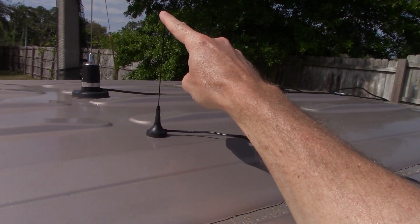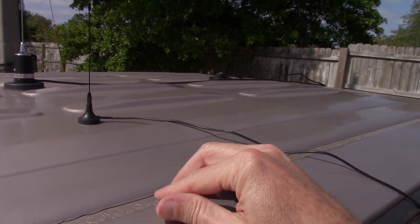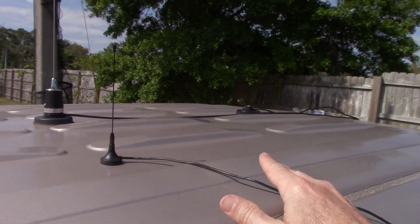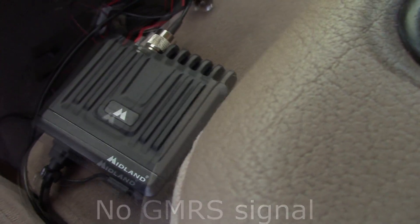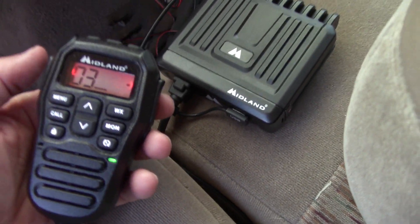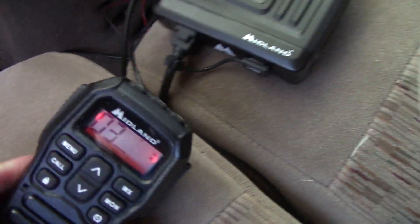Let's consider unity gain on a quarter wave as a common acceptable reference point, so you get negative 3 dB — it's 3.3, but I'll be generous and say just three. Here is the radio on its 20-foot stock antenna. I don't have a continuous signal where I'm at right now, so I'm just going to fire up a weather station — and you can hear it's static-heavy.